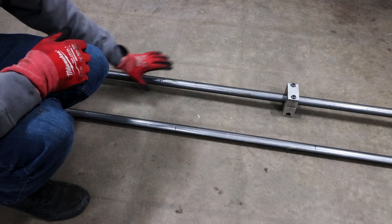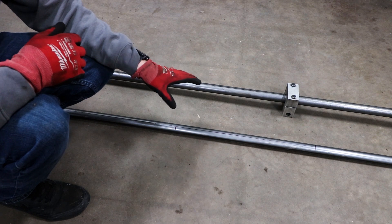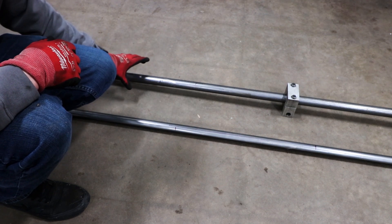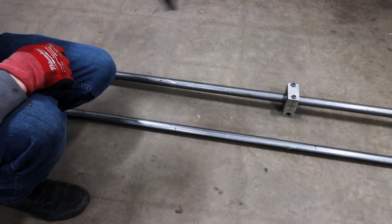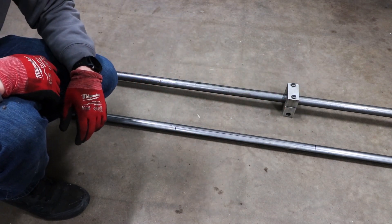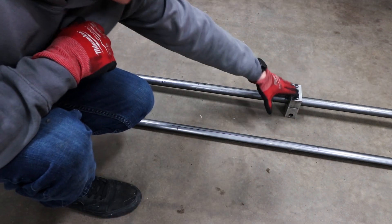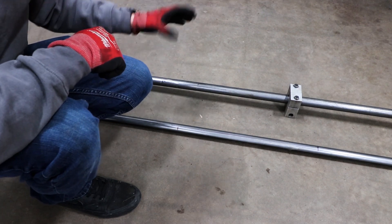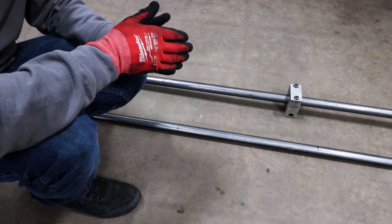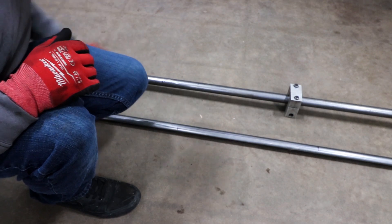This shows why we switched over to the Rogue Fabrication tube bender many years ago. I think we got one of the first batch ones about 10 to 15 years ago off Pirate 4x4, and we've been using it for about 12 years. We used to have a JD Squared horizontal bender — this one's a vertical bender. I like how this has a pressure die that clamps onto the tube, and you can remove it. It keeps the bend in the same place and allows you to keep bending in the same spot without kinking the tube. In this particular case, we're just doing four 90-degree bends, so that's not too big of an issue — but like when you're doing a roll cage or something complex, it's nice because you can continue the bend after pulling the tube out. This isn't a sponsored video for Rogue Fabrication — we bought this on our own 12 years ago. I just like it.